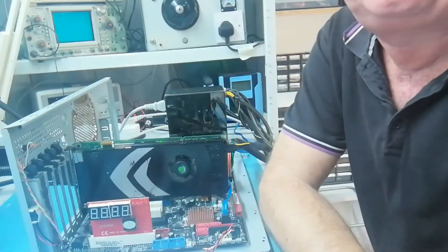So what do we have? Two cards behaving differently. One goes to 2A — which according to the analyzer means it's checking for output devices — and stalls there, trying to initialize the graphics card with nothing happening. The other one also goes to 2A, beeps to say no graphics card present, then continues to boot, but nothing appears on screen. So they're definitely different.